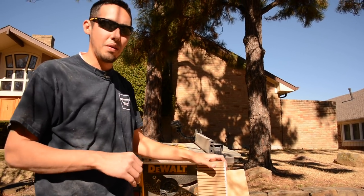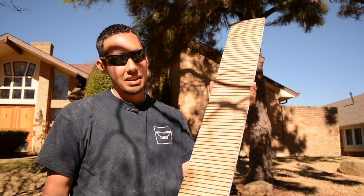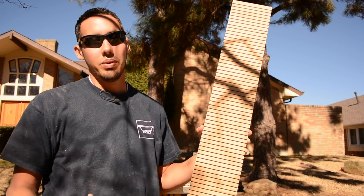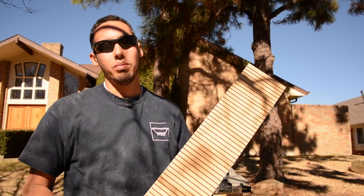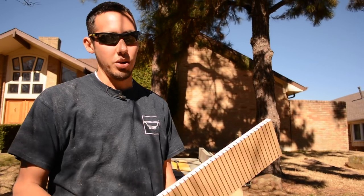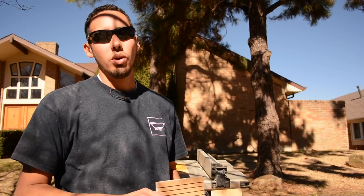You can bend your millwork around that architectural drywall that has curves in it. So there you have it — that's how easy you can kerf a board on the table saw. If you just do it that same exact way using the miter gauge, make sure to definitely wear dust protection because the dust gets ridiculous when you're making that many kerfs in a single board. I want to say a big thanks to Three-in-One Oil for sponsoring this video. Until next time, that's gonna do it for this one — we'll see y'all next time, take care.